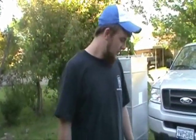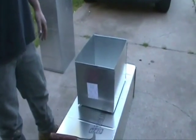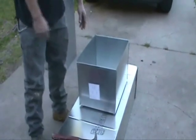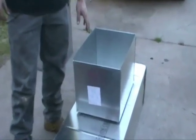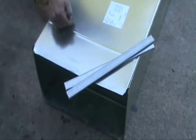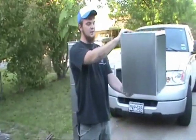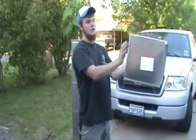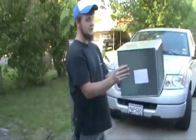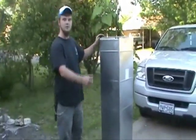I'm going to make a video about putting in this little tap that you tap into the duct. This would be like if this was the top of the duct and it was coming down through the roof from the unit, hanging straight downward through the roof or whatever. You'd come up and put this in it and tap out of it, whichever way, and then run your square duct off of it.